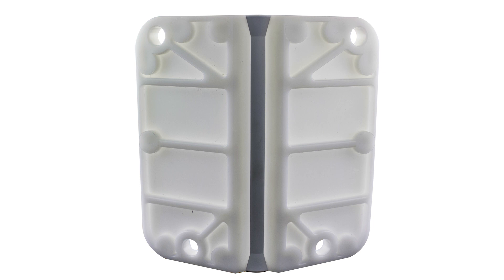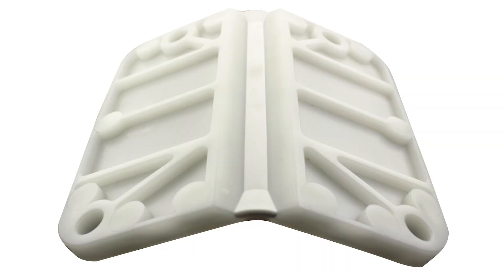Now I've shown you extruded living hinge. Living hinge is what we call scalable, meaning that the principle by which the hinge works — the narrowing of the main body to create a hinging motion — means that if we need a stronger hinge, we just make a bigger hinge. This is a quite strong living hinge made for an industrial application. It is plastic injection molded. Its advantages: it's silent, it takes many many cycles, it's strong, it's flexible, it will not corrode, and it's less expensive than steel.